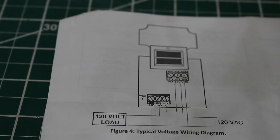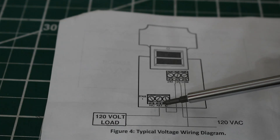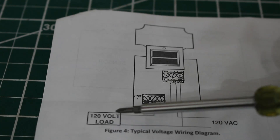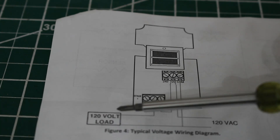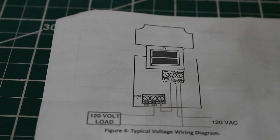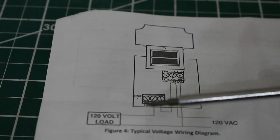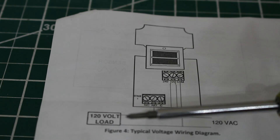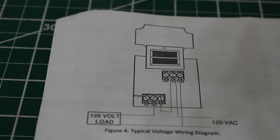When the box reaches 35 degrees, these contacts open, cutting power to the solenoid valve. The solenoid de-energizes, we lose the magnetic field, the plunger closes the flow of refrigerant, and we starve the condensing unit of refrigerant. That pressure drop is going to open the contacts in our pressure control, indicating we no longer need cooling, and the pressure control actually turns off the compressor.